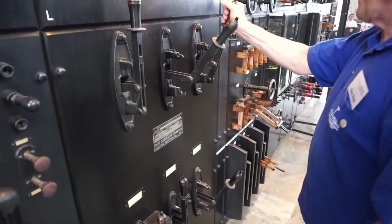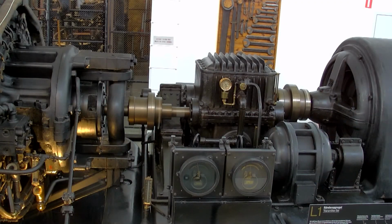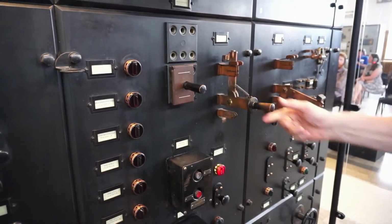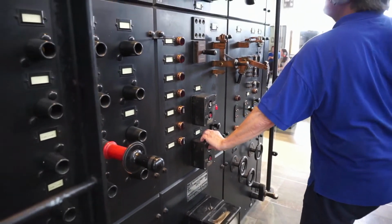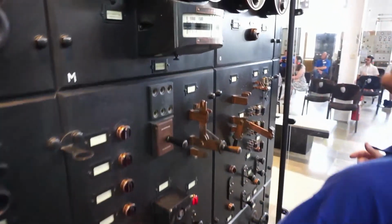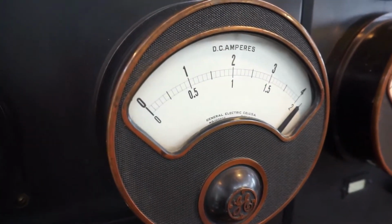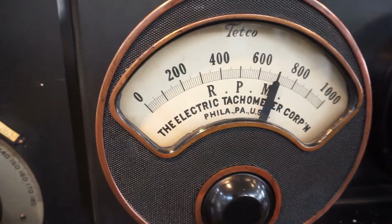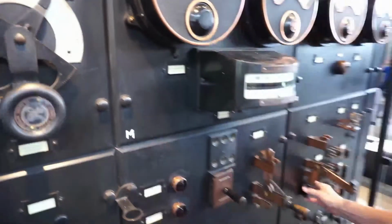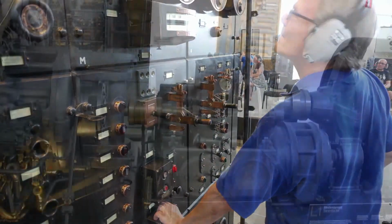Now Jan-Åke is going to the other side of the panel and closes a switch with 500 volt DC to the transductors, so they can give full voltage to the motor, 2.3 kilovolts. At 700 revolutions per minute, he closes the next knife, 250 volt, to magnetize the generator.